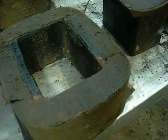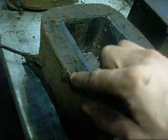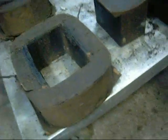Not too hard to clean up, but the hard part is these windings — the insulation is very fragile. You could probably compare it to trying to salvage a logbook raised from the Titanic. There's bits of stuff falling off it everywhere, and try not to break anything crucial. You can see the windings there — there's a coarse wire and some very thin twine. They just bind them up with rope and lacquer them in tar, by the looks of it — a black tar-like substance on them.